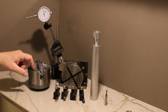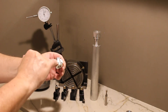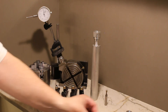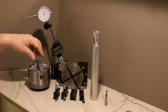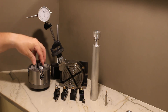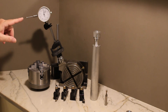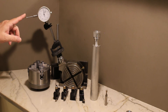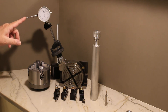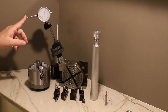This is your four-jaw independent chuck that I talked about. Sometimes when machining these parts, you don't get the distance between the two flats exact, so you can't put them on the self-centering chuck. You've got to break out this chuck and switch them out. Then you use this dial indicator and dial it in — getting it concentric in the chuck, typically within one ten-thousandths of an inch on the diameter. This also comes in handy on the milling machine.